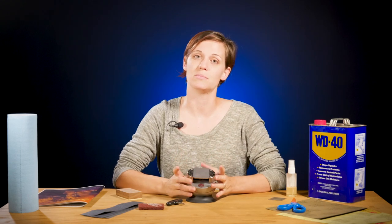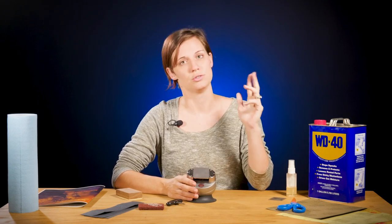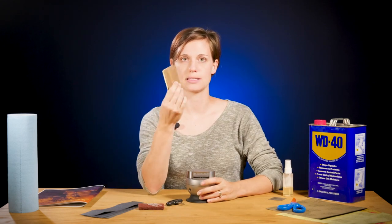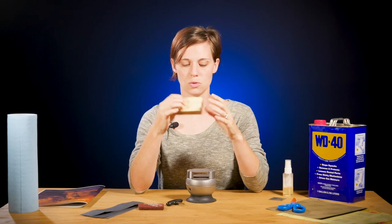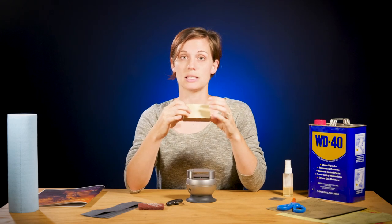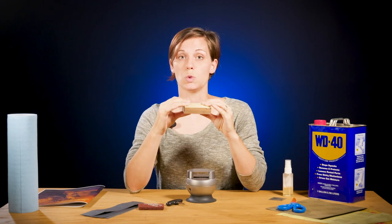We're using this lovely abused practice plate from the back, but this method applies to whatever piece you may be working on — whether it be knives, guns, jewelry, what have you. What we have is an arrangement of different grits of wet dry sandpaper, a little bit of WD-40, and a nice wooden block with some rubber glued onto the surface. When you are sanding, you want to keep your edges nice and crisp. If you use your hand, you run the risk of rounding the edges or creating weird spots. The purpose of the rubber — which you could also use cork, according to Bruce Farman — is that it extends the life of your sandpaper and helps to break down the grit a little bit, and helps transition into the next grit nice and smoothly.